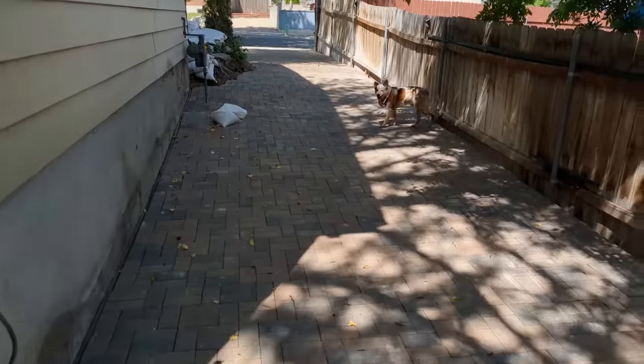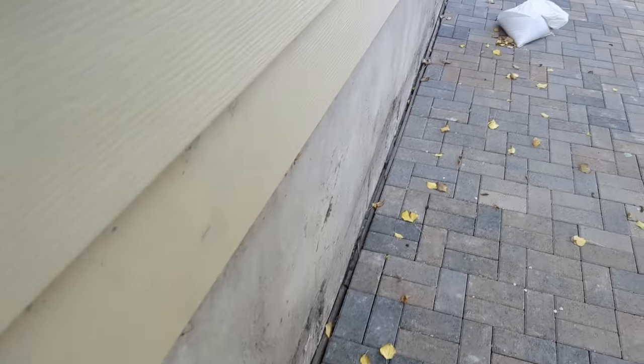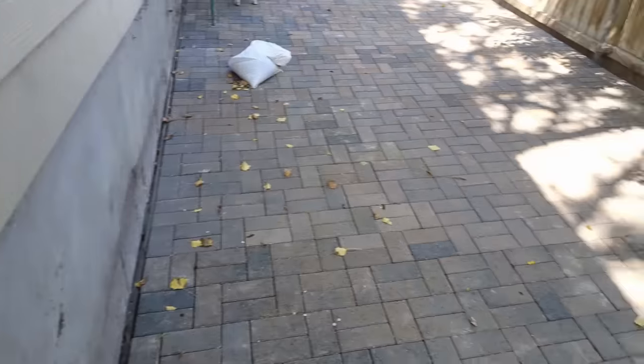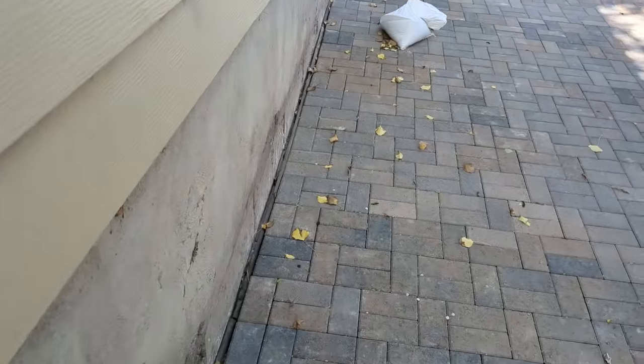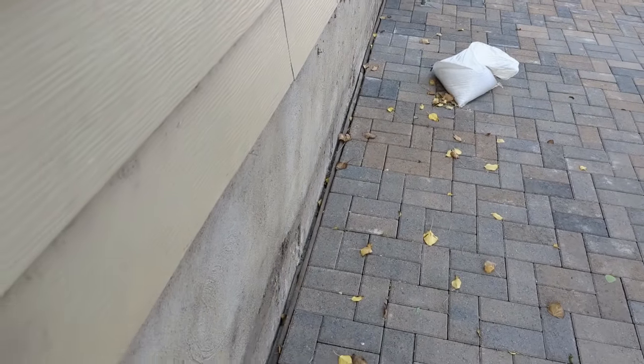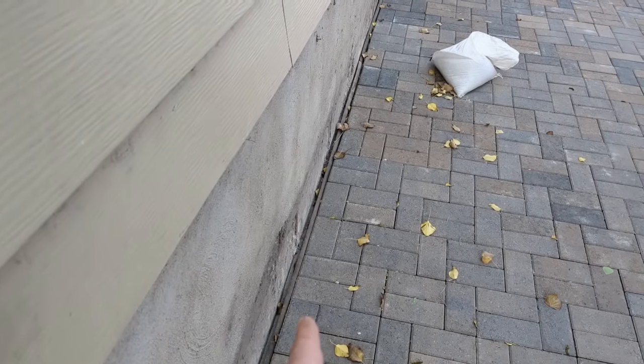In total, 65 feet from the back to the sidewalk up there. Left with about an inch and a half gap along here - I want to use that as an expansion gap because I don't ever want it to push against this wall, I want it to push this way. So I actually put a piece of wood down there as a cushion and to take up some of the space for the sand - you can't have too much sand.